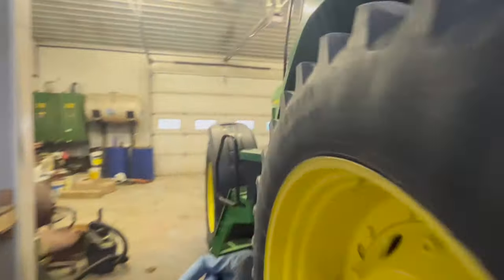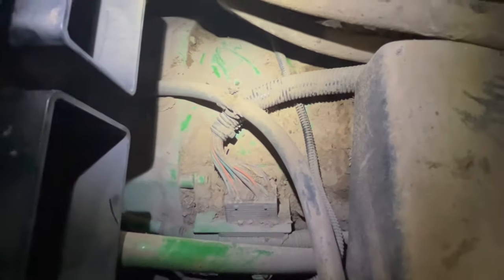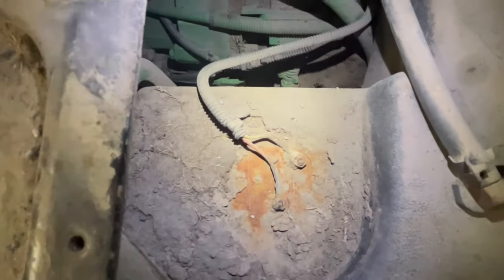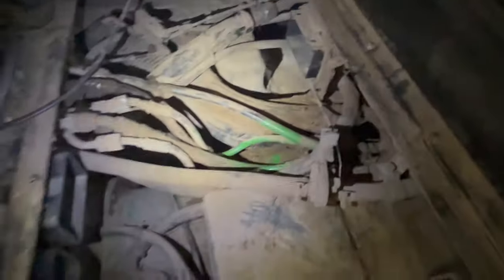There are some wiring harnesses up there mounted in the cab that we'll take loose. On this 19-speed powershift we've got the floor removed up here, so it might be a little difficult to see, but there is a wiring harness right here that has to come apart, as well as these lines that all need to be disconnected. I don't think on this one we need to remove the lines off the fuel sending unit, but it's pretty tight — there's a fuel tank above me here.